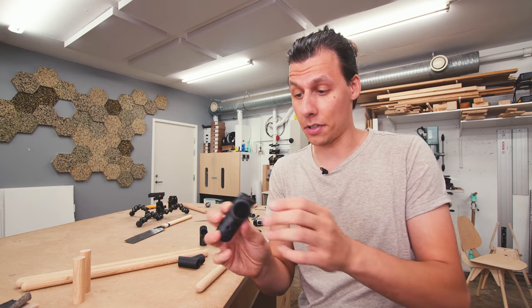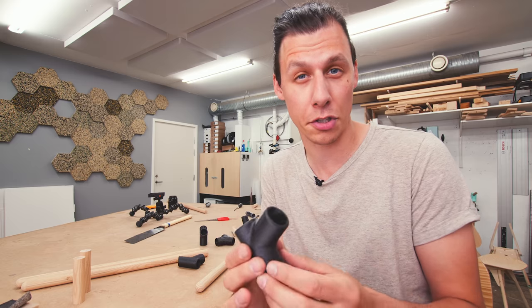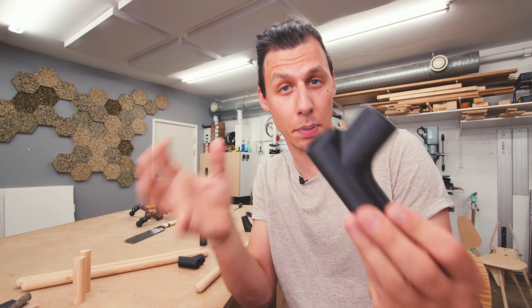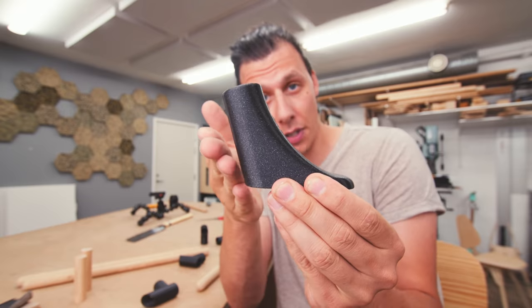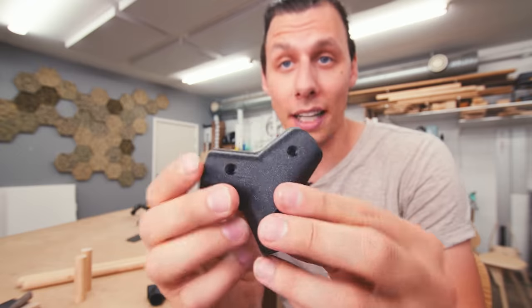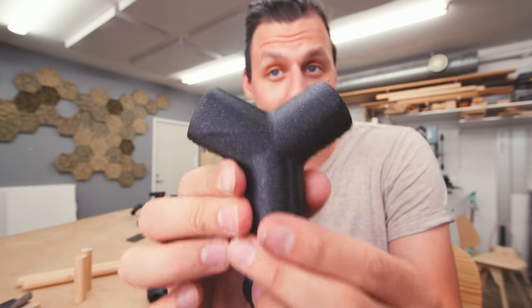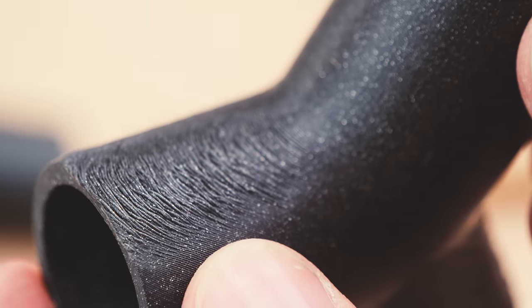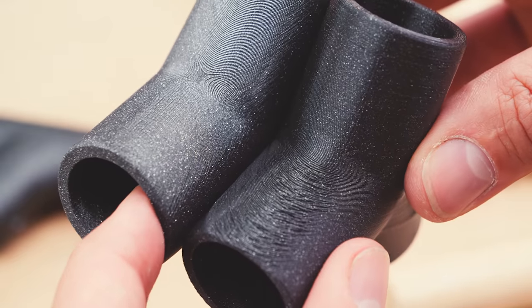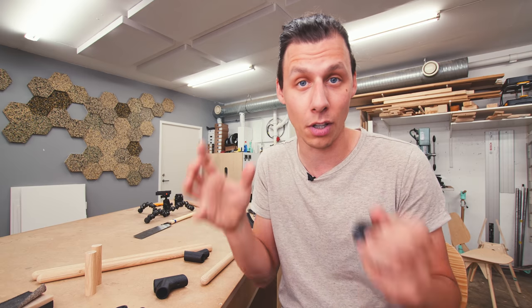All these pieces can be used right off the 3D printer — there's no cleanup needed before you can turn them into a piece of furniture. I usually try to design parts that don't require any support structure while printing, meaning there can't be any overhangs bigger than 45 degrees or they won't turn out as nice. That's also why the centerpiece is slightly thicker in the center — so the angle on the side isn't as large. I initially printed it with straight sides, which meant a 60-degree overhang and a rough surface finish, so I switched to the thicker version. That's generally how I design parts for 3D printing — none of the parts for either this project or my other projects require any support material.